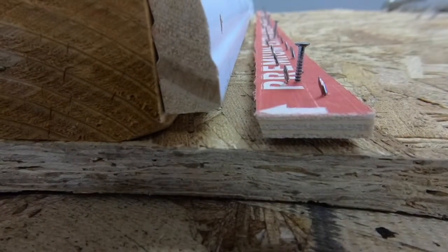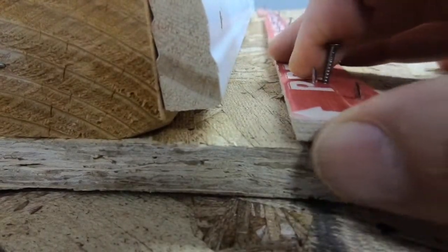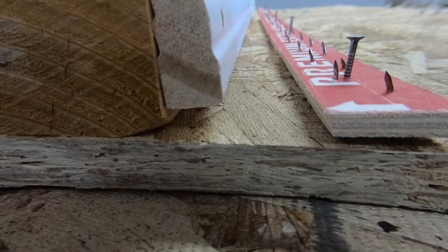With raised base, it's better to have the tack strip on the closer side rather than the wider side. You don't want to end up with the tack strip way out here, especially when the baseboard is off of the floor.